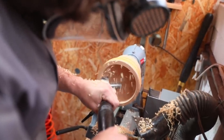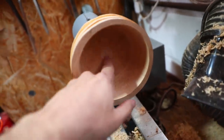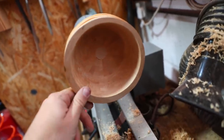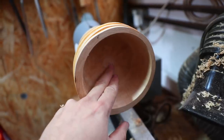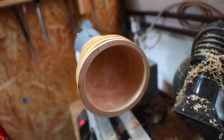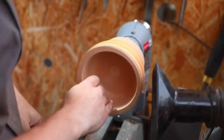I think that's as good as I'm going to get on the side. I have sorted out the transition — there is a very shallow radius in there and I'm pretty happy with that. Managed to get out all the glue. There's a shallow dish in the bottom of the bowl that needs a bit of smoothing out, but I'm struggling to do it consistently with scrapers and bowl gouges. I think sanding will get that out. Not that I like to rely on sandpaper, but it does get me out of sticky situations. Once I sand it, we can start doing the outside.